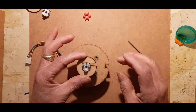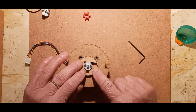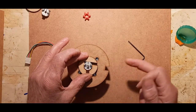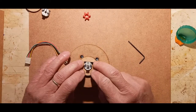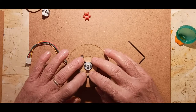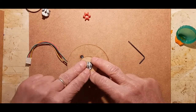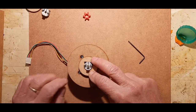And then we drop that over the motor, and to make things a bit simpler, where the slot is there, if you also make the slot there roughly in the same position, and that should sit down smoothly and snugly onto it. So you then push the outer, the thicker piece of MDF down onto the disc, and then you're able to push down the actual coupler itself.